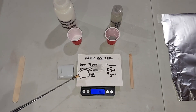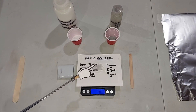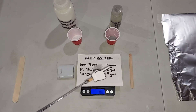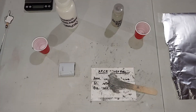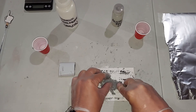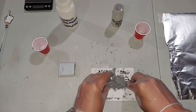I start with exactly four grams of silicone and add both the aluminum and ammonium perchlorate to it, mixing them in. It seems impossible but they will get mixed in. I have to start quickly because within 30 minutes this will cure enough that I can't work with it. The aluminum is going to be wrapped around what I hope to be a roll of rocket fuel, then I'll cut it up like sausages. I've got the aluminum mixed in — very messy — just finishing up with the last of the ammonium perchlorate. Eventually this turns into a sort of putty which can be handled with gloves and formed easily.